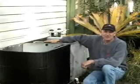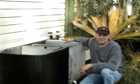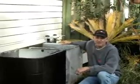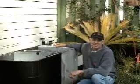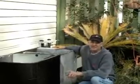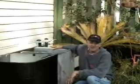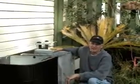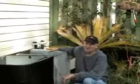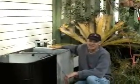The next step is we want to put in a larger step-down transformer that will take us from 208/240 to 24 volts and 75 VA. Right now he has a 40 VA transformer and we want to put in a 75 VA because we're going to be using a little more electricity for some of the add-ons that we're about to feature in this video.